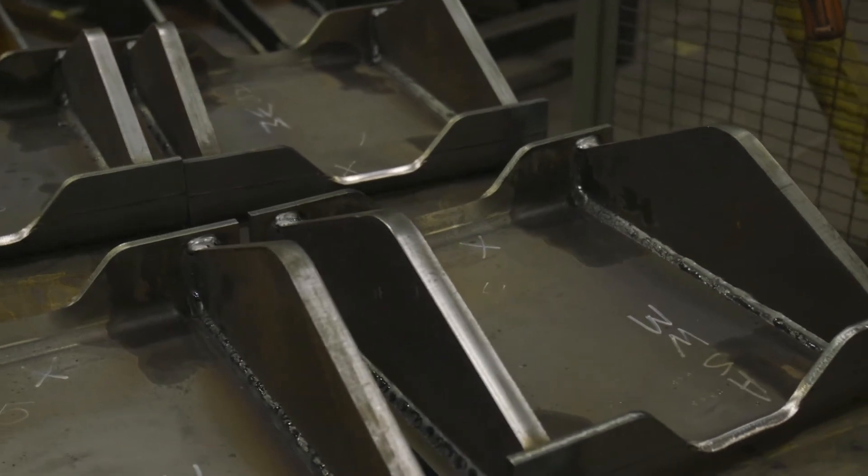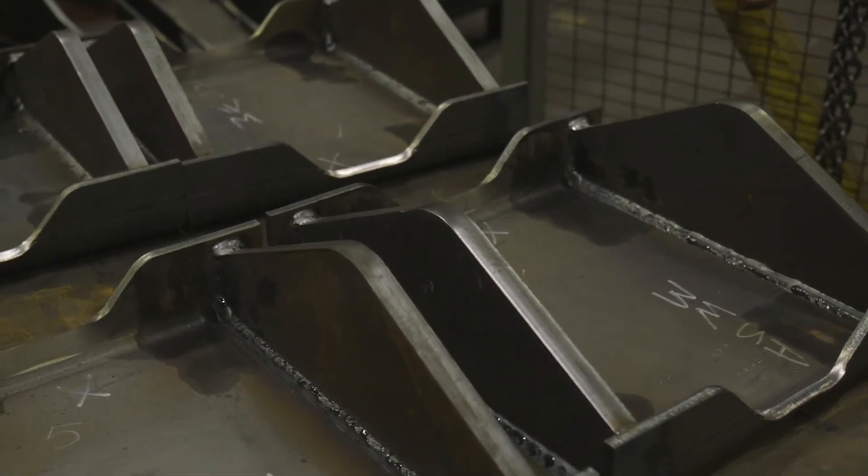If your application requires these higher demands, then a water-cooled torch is a no-brainer. If you don't require those higher demands, then pay attention to other factors like overheating and the access your robot has to parts. Consider the material you are using — is it reflective like aluminum? Are the parts preheated before welding? These factors can increase the working temperature of the torch, and if air-cooled, it could overheat or fail entirely.